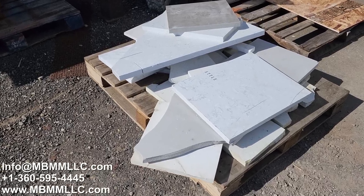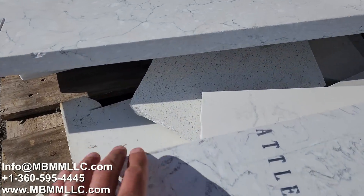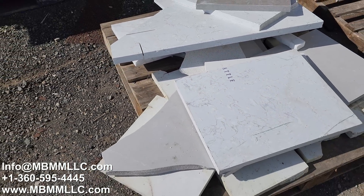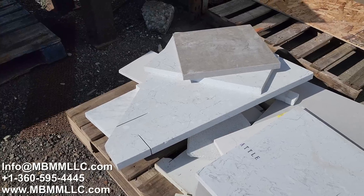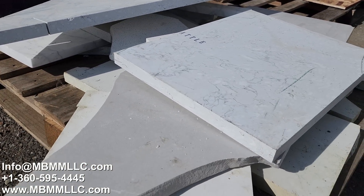Here's a quick look at our quartz samples. There are a bunch of different types, but they're all essentially little pieces of rock. They can mix glass in them, rock dust, and then they mix them with a polymer plastic type of binder that holds them all together — giving you those nice smooth countertops. Some of these pieces are quite large, but as long as they fit down through our 30-inch wide jaw crusher mouth, the crusher will crush them up real nice.